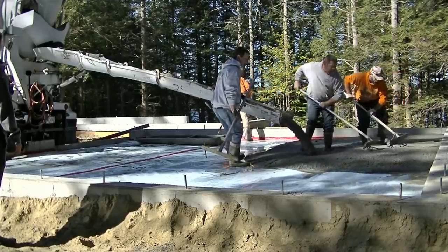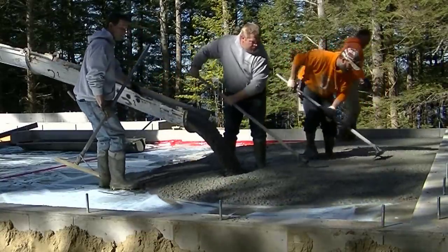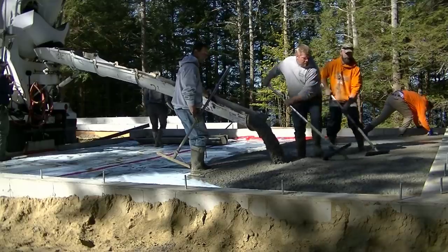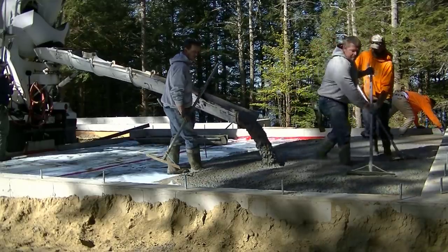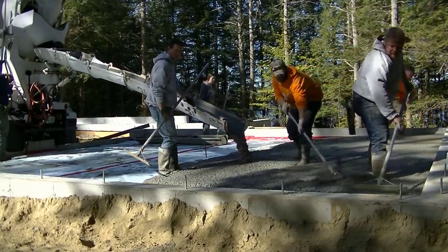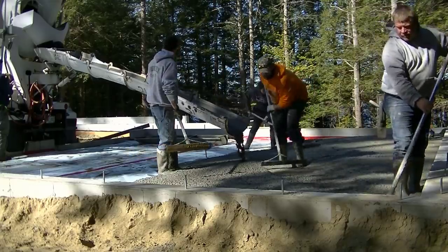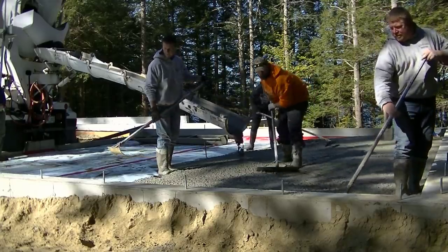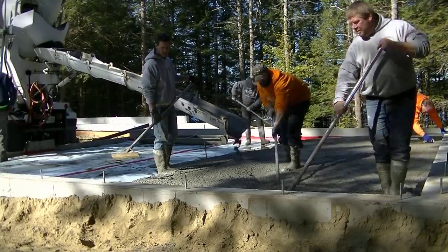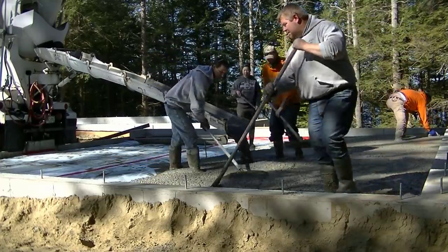So what we're doing — we got a 26 by 26 garage floor. We also poured the house here today; that'll be on another video. There was 30 yards we dumped in the house and got that poured, and now we're jumping onto the garage. It rained really hard just before we got here this morning, so there's all kinds of water on top of the plastic vapor barrier. As we're dumping out the concrete, we're trying to work that water backwards so we can get all that surface water off and it doesn't get mixed in with the load.